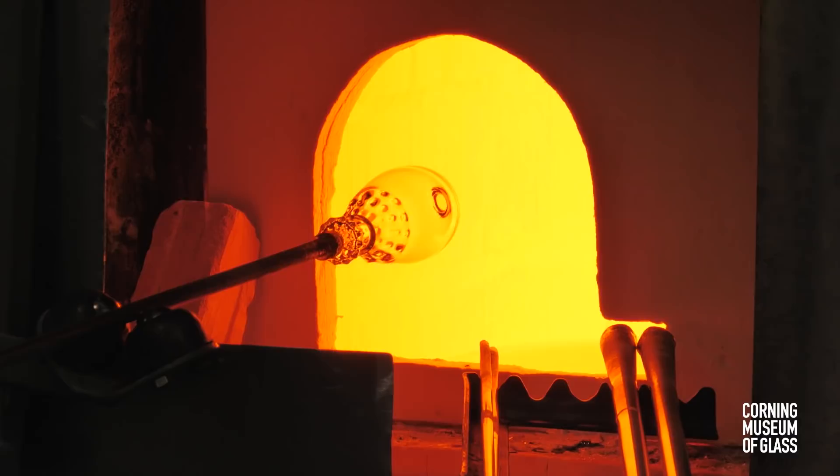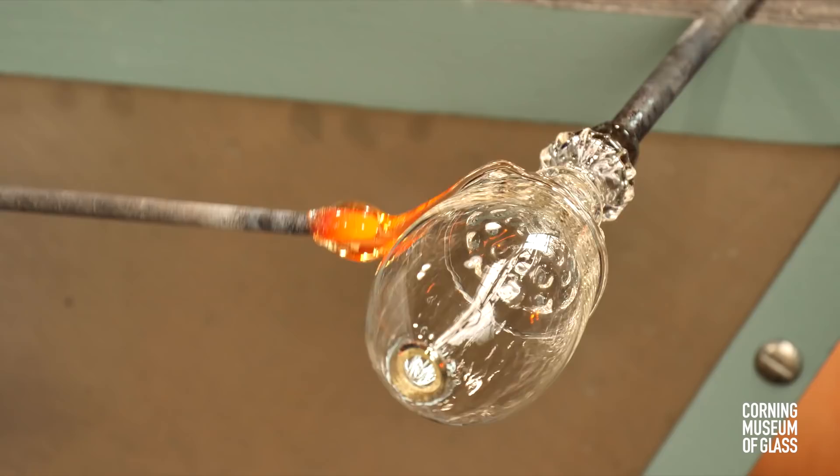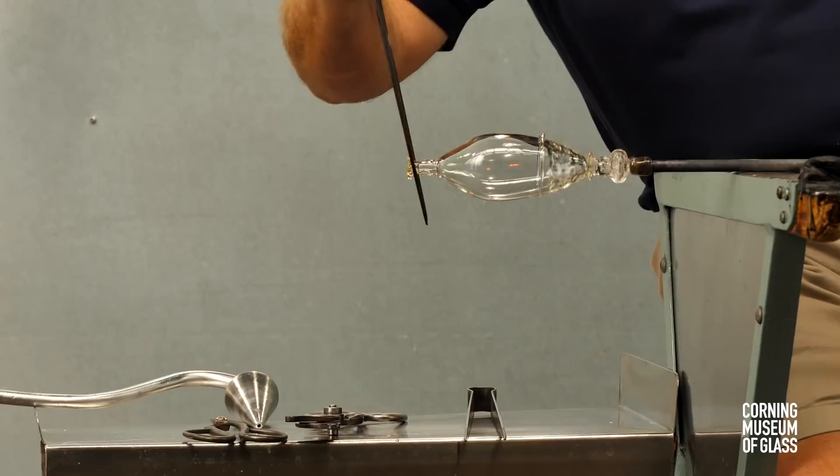A tiny gather of glass collected on the end of a small metal rod is added, creating a thin spiral thread. Edges of dragon stem goblets like this are exceedingly thin and require a special lip thinning procedure. The thick glass is pulled outward, a new constriction is made, and the thick glass is broken away.